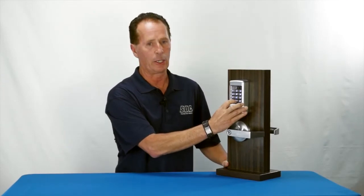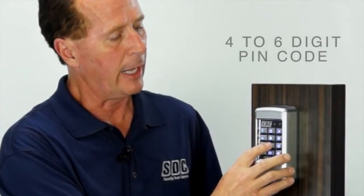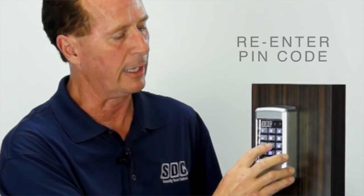Now we're going to add a code. We're going to go #01#. That tells us that we're going to put a code into this unit. Then we're going to give it a user identification of #02#. We're going to give it a four-digit code, #9876#. We're going to reintroduce that code, #9876#. And then we're going to give it a 24-hour, 7-day-a-week access, and that will be #06#. That verifies that it went in.